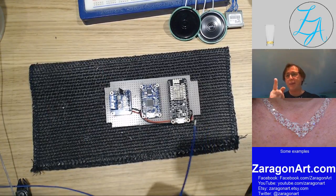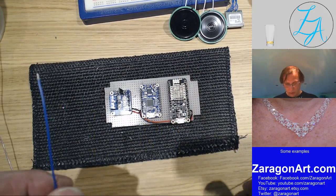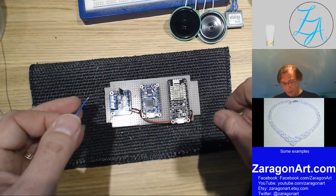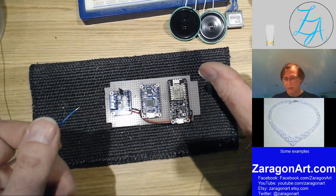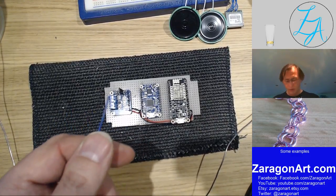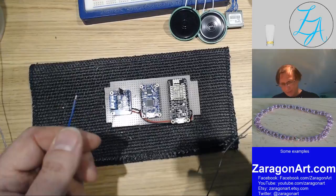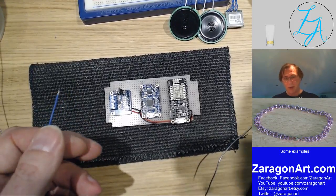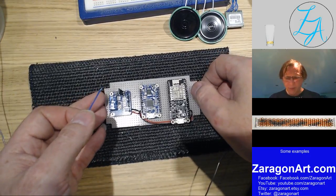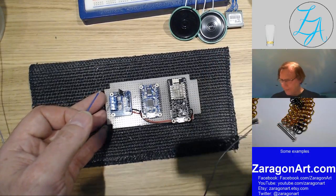it's a bit of a pain in the neck to set the extractor up over there in front of me. I should do it, but I'm not doing a lot of soldering. Still should do it. You can actually get some really nice small fans that suck through a carbon filter, which tends to neutralize the compounds, which is a really good idea. So if you do any soldering, get something like that. Or at the very worst, just a gentle fan that will blow. Not a really big fan, because it keeps your soldering iron too cool, but just a small one is really good, at least so you're not breathing it.